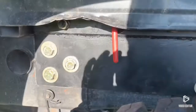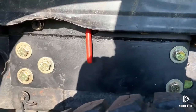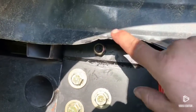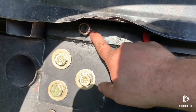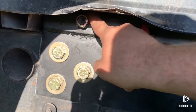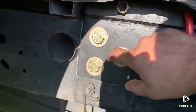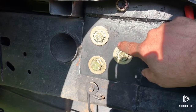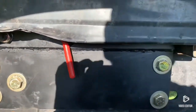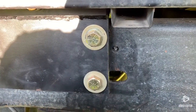There's the finished product. Ended up welding another piece of 3/8 flat bar on — you can see the cross pieces where they bolt. The metal was kind of thin so I went ahead and put that piece of 3/8 flat bar there. The nuts on the back of those bolts were a real pain — should have made them further back, would have been a lot easier. You can see my spacer and bolts — they're all 5/8 grade 8 bolts.